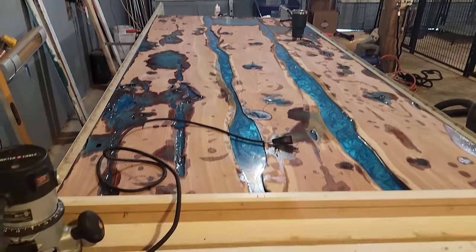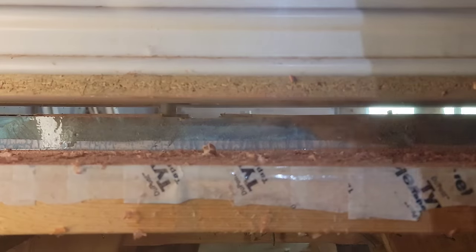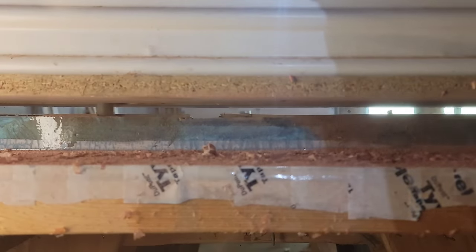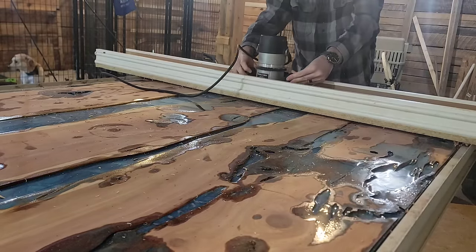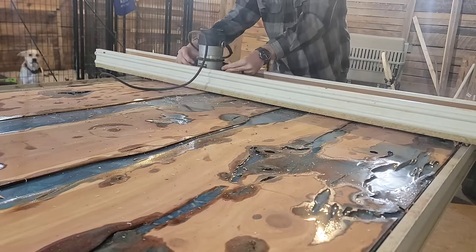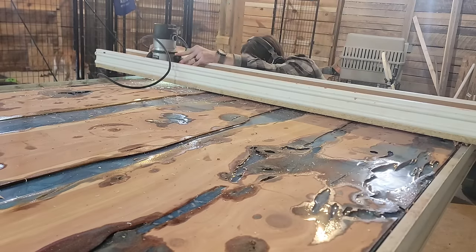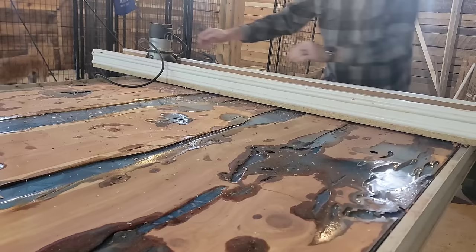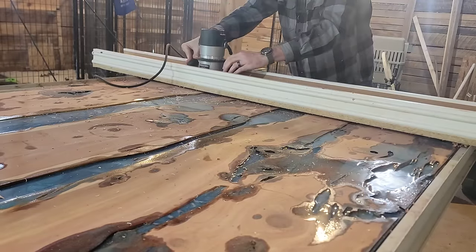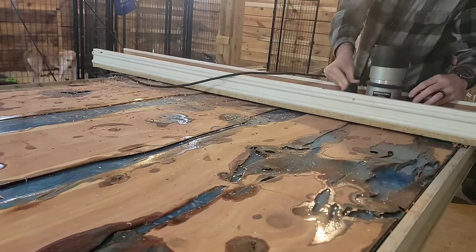So I found some aluminum decking boards, actually. They're aluminum. I clamped them to the sides of the table perfectly straight. Spent a very long time making sure they were perfectly straight. And we used this router jig setup to just make 1,000 passes back and forth across the table until I had routed it all to as flat as I was comfortable with.